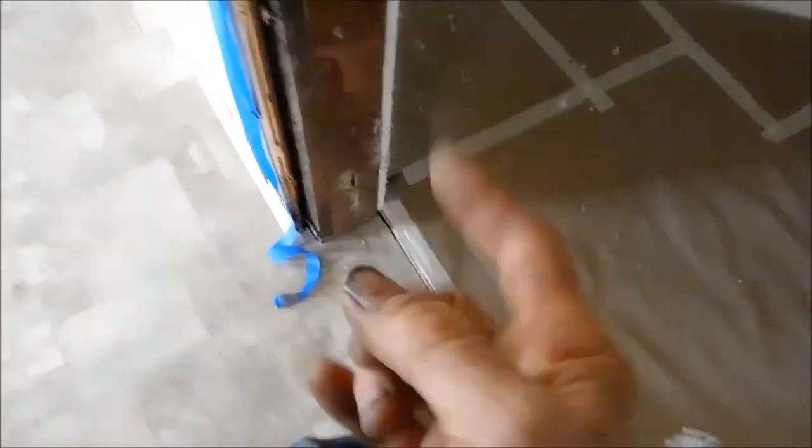Quite the collection of items down here. The sockets are coming from underneath, but there's power up here though. Somehow or another, might have to cut a hole in this, bring a switch up here, run a line to that light possibly. It's not a real easy job. These wires actually come from down below, so we're going to have to investigate the basement or crawl space and figure out how to run a wire up through here and put a switch in.